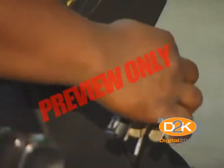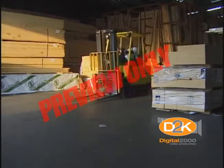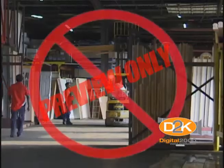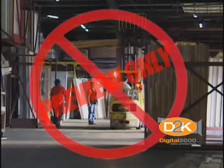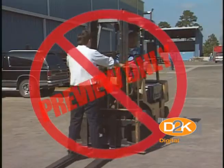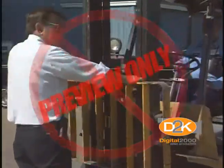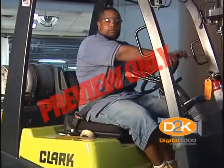Let's now discuss truck operations. Trucks shall not be driven up to anyone standing in front of a bench or other fixed object. No person shall be allowed to stand or pass under the elevated portion of any trucks, whether loaded or empty. Unauthorized personnel shall not be permitted to ride on powered industrial trucks. A safe place to ride shall be provided when riding of trucks is authorized.